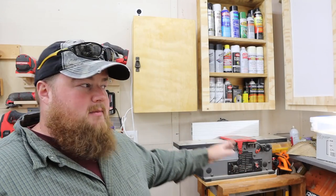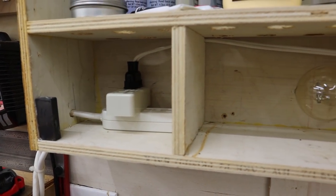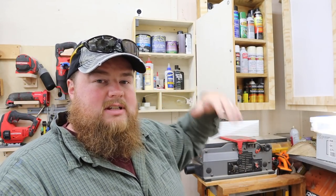Can you call it a cabinet if it doesn't have doors? It's probably just a shelf. In addition to the spray paint cabinet, I did move over my automatic self-heated glue and finish storage cabinet. This thing has been going for a couple of years pretty flawlessly and I really like it. There's an old video on my channel showing me building it — basically it's a closed cabinet with a thermostat switch that controls an incandescent light bulb that puts off heat. It heats the cabinet to keep it above freezing but not cook everything and turn it into a fire hazard. There's a link to that video down below, and I also sell plans for this cabinet build along with product links — all on my website, sam-craft.com.